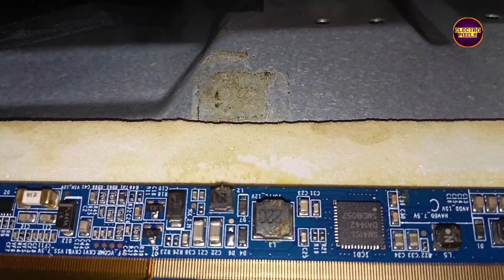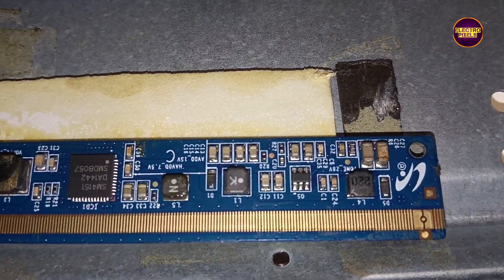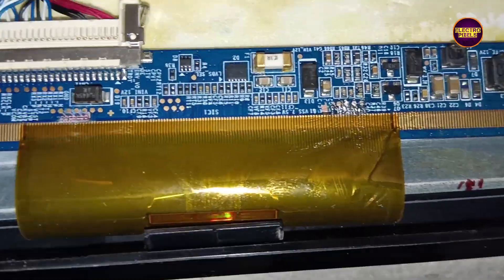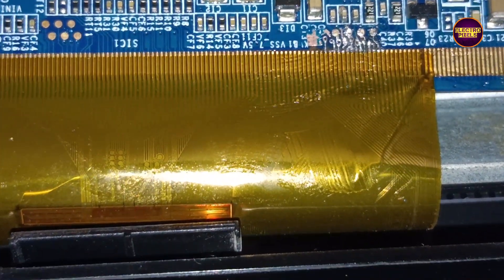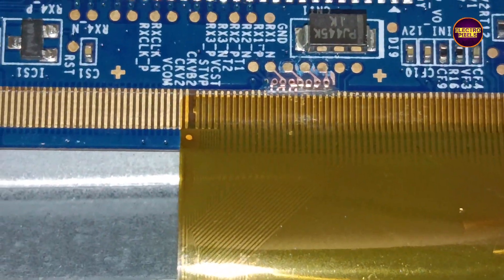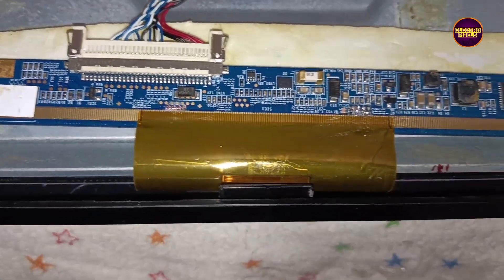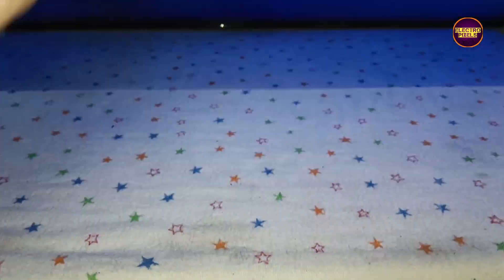This panel's DC IC goes into protection mode. These are the gate signals from the right side and left side of the glass panel respectively. First, we are going to cut down the right side gate signals. If picture is okay after that, do nothing. If picture is not okay, rejoin the cut tracks from the right side.